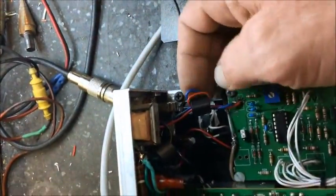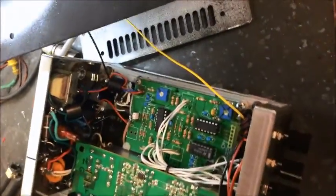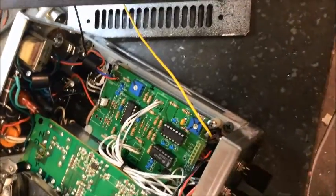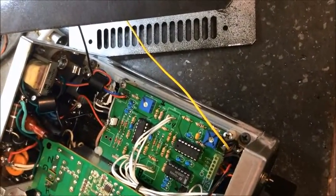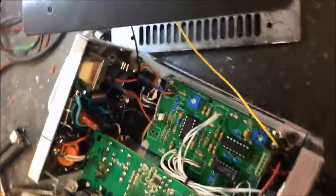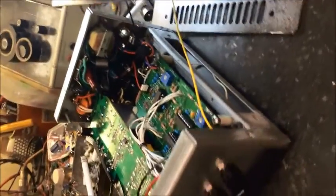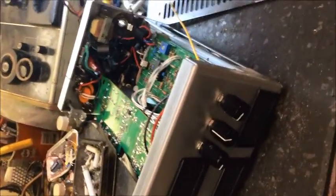At first I thought it was the main chip in here, which is up under here, and that's going to be another story in a minute too. But I ended up finding out that my negative voltage supply, when I keyed down, was going south on me. Basically it'd be -15, and then when I keyed down, for some reason it was dropping to -10. I mean, that's what I probably get for using an old wall wart type power supply. Basically one of the plug-into-the-wall jobs that you would use for a toy or accessory or something like that, and that's what I had used.